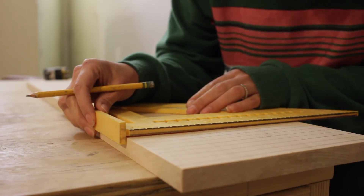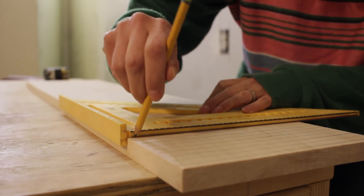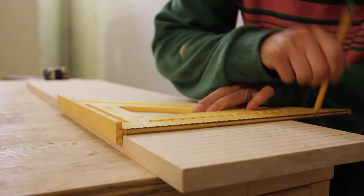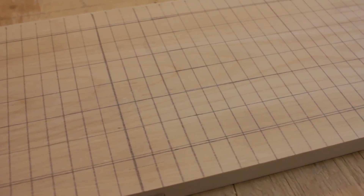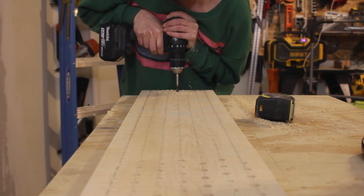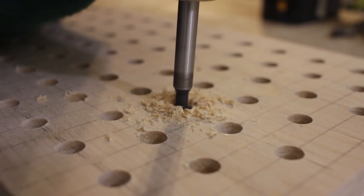I gave the board a quick sand and then moved on to the layout of the holes. I used a pencil and a square to create a grid so the holes would be spaced one inch on center. I actually created a 3D model so I could visualize how the grid would look on the board before I started making any marks — I've included an image of that diagram on my blog, so there's a link in the description. Next I began the very tedious work of drilling all the holes. I intentionally didn't count the number because I didn't want to feel overwhelmed, but there were hundreds and hundreds of them.